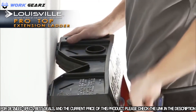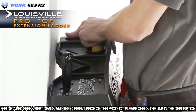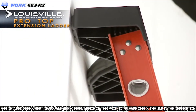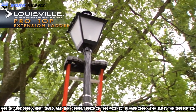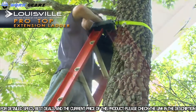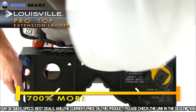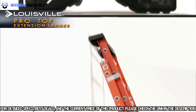ProTop, an exclusive Louisville Ladder design, is a multifunctional top designed to make work easier for electrical utility, heavy construction, and residential jobs. ProTop features include an integrated bumper — a soft, non-marking, non-marring rubber tread that protects the work surface. A pole grip with V-shaped design and rubber tread makes it ideal for working against poles or trees. Tool slots provide the option for lashing the ladder to a pole or tree. The corner grip V-shaped design provides greater stability on corners. A wider design provides 700% more contact area on flat surfaces, and a non-conductive molded work tray with convenient handyman's tool slots.